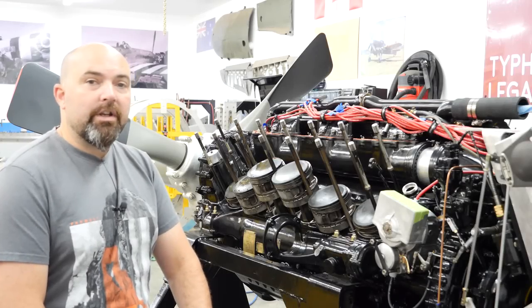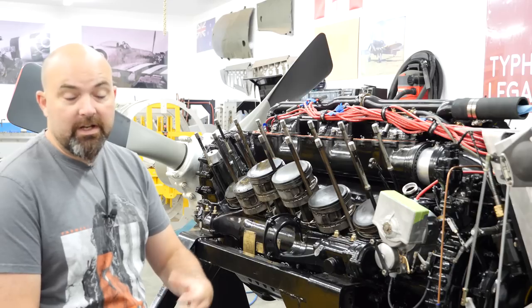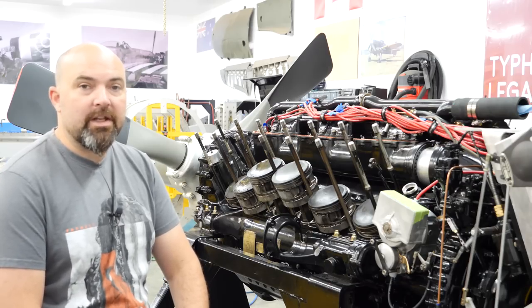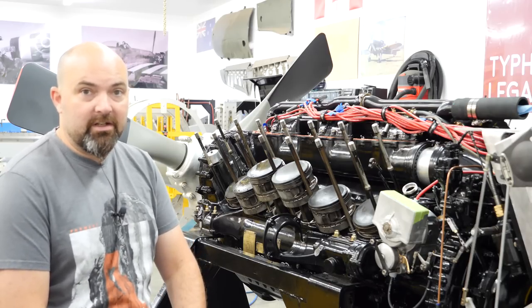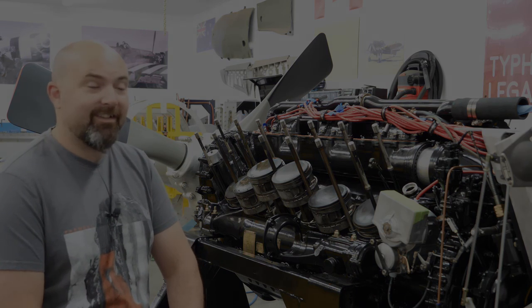You'll notice through these oil drain tubes pass our cylinder block studs. So there's a series of these, they pass through, and the oil's allowed to drip down. It actually protects the studs quite well. But you can see and hear in this case that we had quite a substantial leak on one tube. We're fairly fortunate that it was isolated to one, but it's something that we potentially could have caught if we would have done this early on. So shame on us, but here we are.